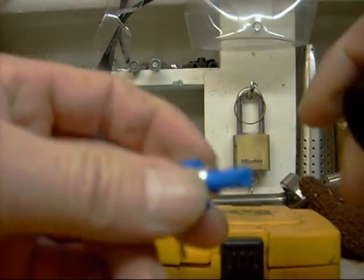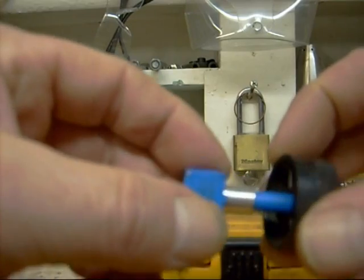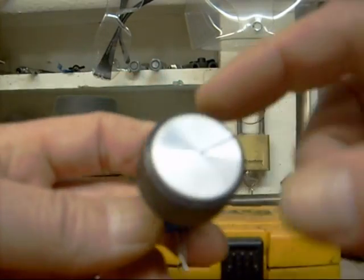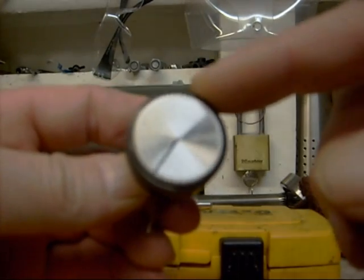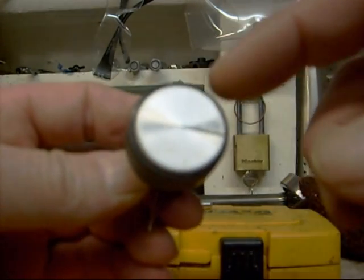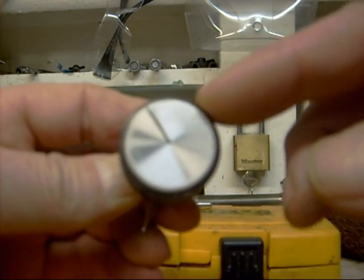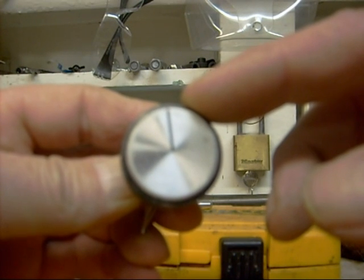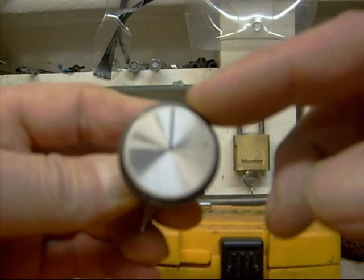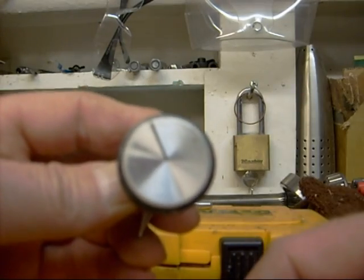And this is the potentiometer here. I'll put that in a box and on the outside of the box we'll stick one of these control knobs. This will fine tune the speed of the electric motor which is attached by a pulley belt to the alternator, so we can get the voltage coming out of the alternator exactly at 460 just by adjusting this — we hope anyhow.